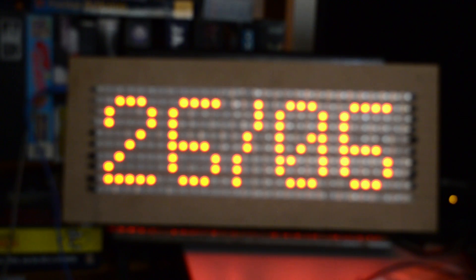It's got time in hours, time in date — day and month. The next steps are self-generating patterns. We've got the matrix-style pattern, which I'll use in the next video to explain how the FastSPI library works. Then we've got the droplets of water — the raindrops. Then we've got the multicolored snake, which utilizes the hue wheel feature of the FastSPI library. Finally, we've got video — a series of bitmap images that, like a flipbook played quickly enough, give the illusion of video. I'll go through that in another video as well. So that's pretty much the project, and in the next steps we'll go through these one by one.